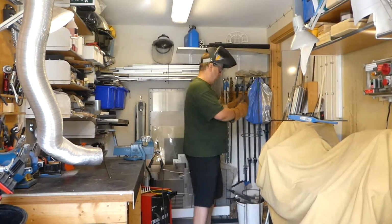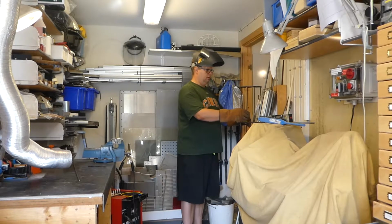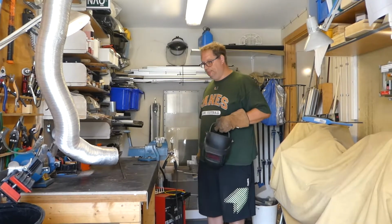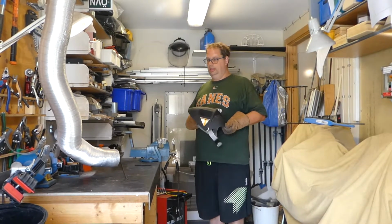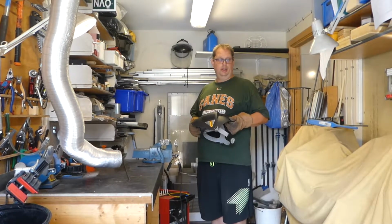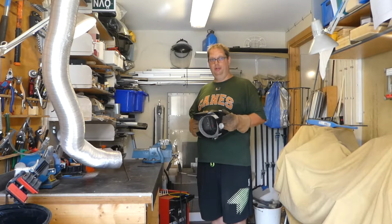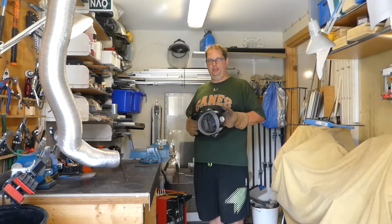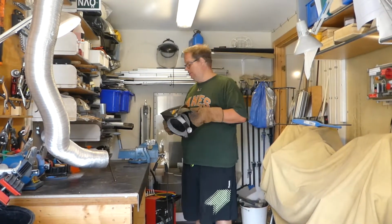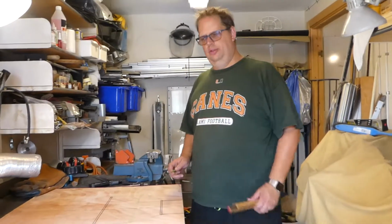So stand down. Then it's time to do some bending again. Make one rod that is pi multiplied by 400 and start bending a circle again. So we're going to cut this up and then come back when I make one more circle. I hope that this is going to be a little bit easier since it's 6 millimeters. The other one took some elbow grease to get it in place. So see you then when we start to bend it round.